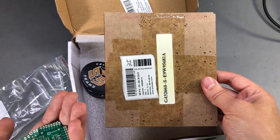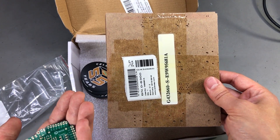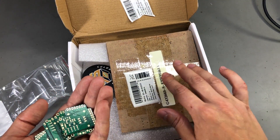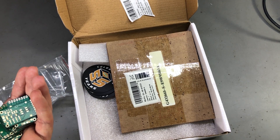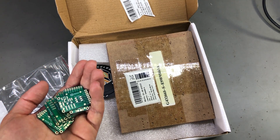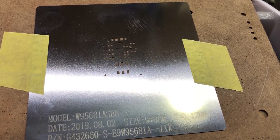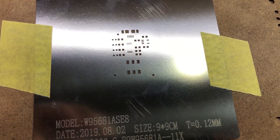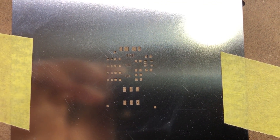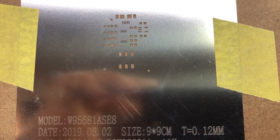These will be handled by hand a lot and I don't want any flexing in the PCB to cause failures on the solder joints. I also ordered a steel stencil because my components are surface mount and a stencil always helps with applying solder paste in a professional way. These days stencils are so inexpensive and they help so much during assembly — they are totally worth the cost. The stencil looks to be of very good quality: nice clean cuts, and I love the fact that the area they sent me is so small and compact, with very little waste around the used area.